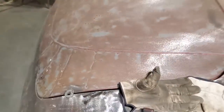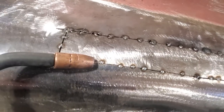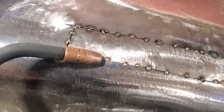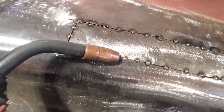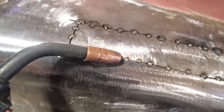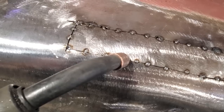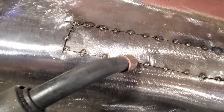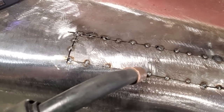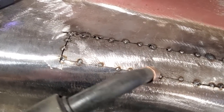It's a technique I picked up a very long time ago. When you look at a weld, most fellas will weld, and you'll see the tip of the weld like that, okay? You're welding along like this here, and they're looking right at their spot weld. Now, just pretend I was doing that spot weld there. This is what I'd be doing. I wouldn't even see that spot weld, okay? I move over to this one. I wouldn't even see. It's just a technique of knowing where the tip of the gun is at each time I come across. This is all I do.